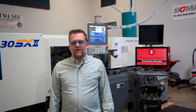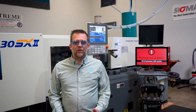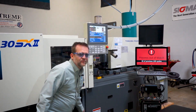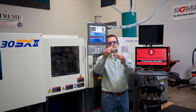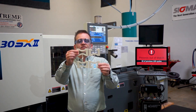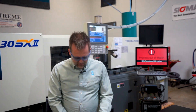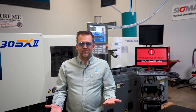Good afternoon. This is Jason Robinson. Thanks for joining us on the REJG YouTube channel. Today I'm going to discuss something we've all probably dealt with at one point in our career: a short shot. So right now I walked up to this machine a minute ago and it's making short shots. A short shot — also called a non-fill — means I don't have all the plastic in the cavity. We didn't put enough plastic into the cavity, and there are many reasons that could cause that.